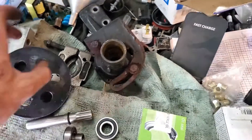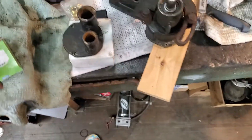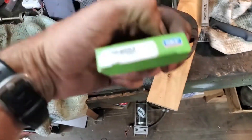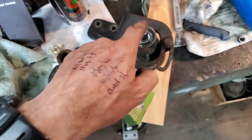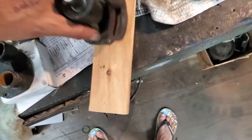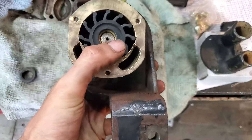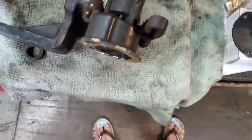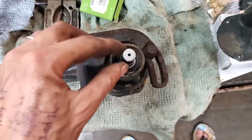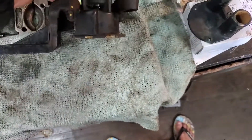Other than that it's pretty straightforward - thanks for watching, safe boating. Quick supplemental: this seal number is in fact the correct one for the older V-belt style and it also works on the Volvo Penta serpentines. For Pete's sake, please grease the impeller shafts when you put it in - use marine grease if you can. I actually managed to tap the whole assembly in with a block of wood just to show you how loose of a fit this normally is.